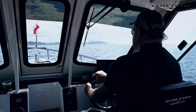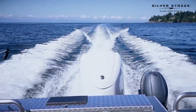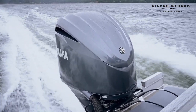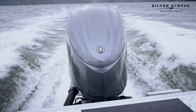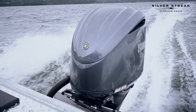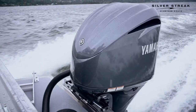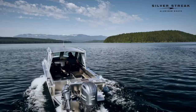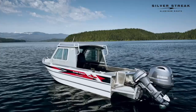beginner to advanced. Each boat has a horsepower guideline, which indicates the maximum horsepower limits for that boat. Too much power can become a safety issue, either by the power itself or the sheer weight of the larger engine. Not enough power may cause untimely engine breakdown or an inability to get to plane, which then can create issues with maneuverability and visibility for the driver. Your boat should be able to come up to plane when underway and sit only slightly bow high in the water when still.